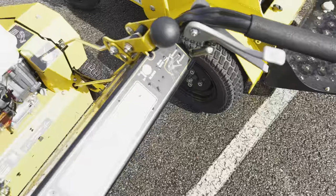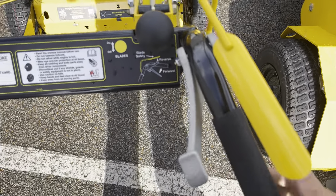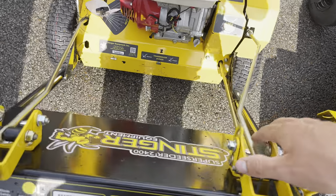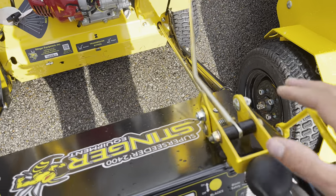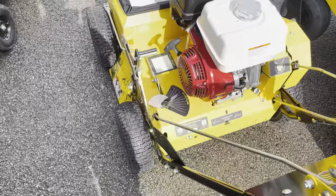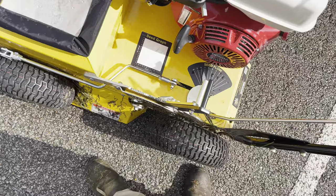You can control it — you don't have to push the safeties down just to move it, but when you pull this lever it goes forward, and when you push this it goes backward. Simple hydro-style controls. You have to push these safeties down when you have the blades or seeder engaged. This side is your seeder engagement, this side is to engage your blades. You've got your depth adjustment here — just pull it up and set it wherever you want — and your seed flow control. That's really all the controls.